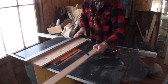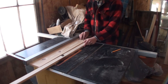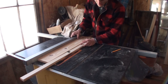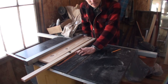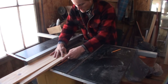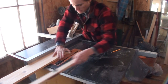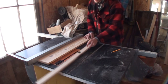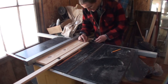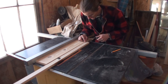We're going to pretend this is the table leg piece we're going to taper. Normally your jig should be a little longer than the piece you're tapering. The piece goes on there, and you should be able to see the shadow line that shows the taper. Move your fence so the blade enters at the point you've marked — the blade will start the taper at your mark. Then check the backside of the blade to confirm it exits at the right point to create the correct taper at the bottom. I make fine adjustments, get the first cut perfect, then run through all the legs.